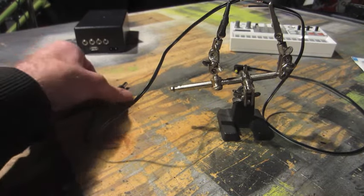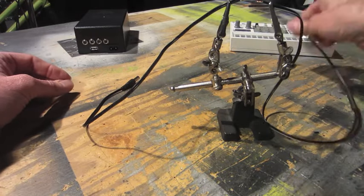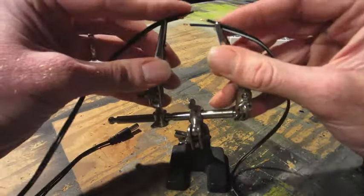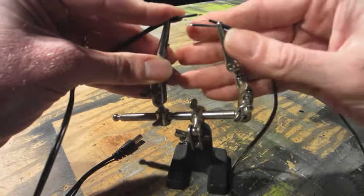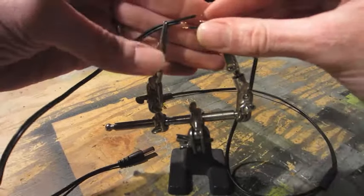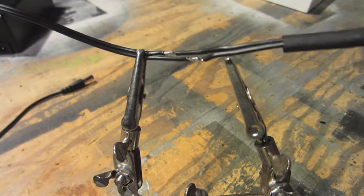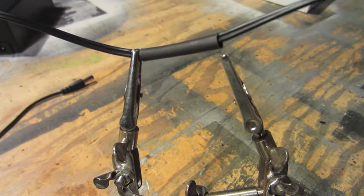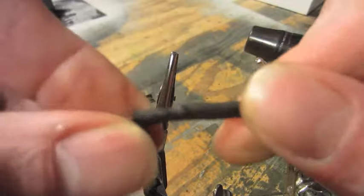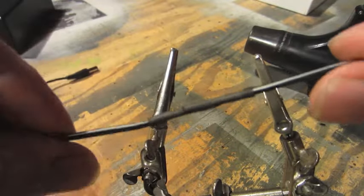Now I'm going to make the cable that connects between the power supply and the Korg Volca unit. I'm just using the tail from the power supply and a piece of cable I purchased that fits into the Korg Volca. Each cable has a white stripe which designates positive, so I'm just matching those up. I've trimmed the wires in a staggered fashion and I'll solder them like that. I also added a piece of heat shrink first, so once I solder it all together it'll be one nice smooth piece. Once soldered, I slide the heat shrink over and heat it to shrink it down — now I have a smooth junction without a big lump from multiple layers of heat shrink.